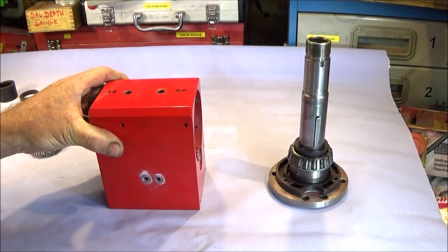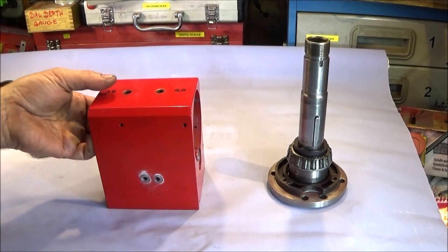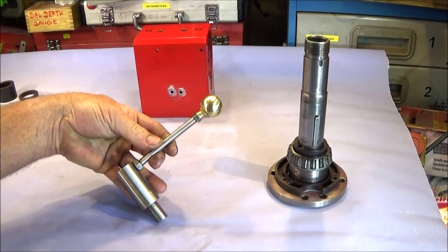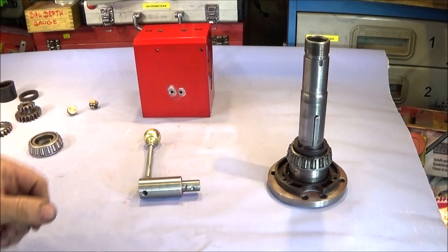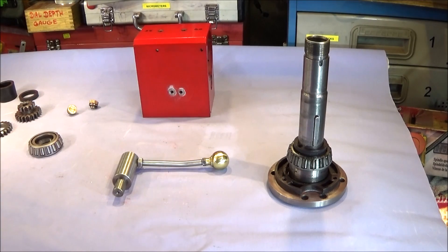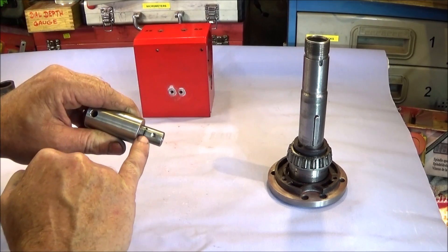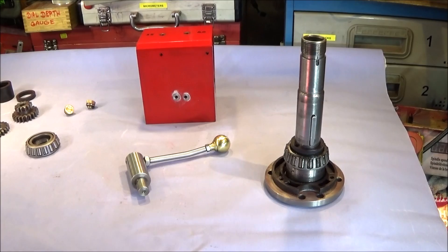It's a nice size inspection hole - you can clearly see the gears. You can clearly and easily oil them while the machine's running and ensure that they don't dry out again. While I had it stripped down I also made myself a deluxe handle out of stainless steel and brass - a much longer handle and longer standoff from the back of the headstock so I can see it and reach for it clearly and easily. I think this one's much better suited to the lathe.